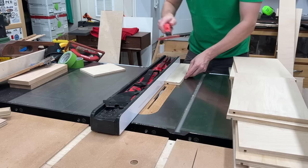I added a quarter-inch piece on the bottom to build up the slide because I'm installing some lateral stabilizers, which require extra room on the bottom so it doesn't rub on the cabinet bottom. You see that wiggle when you pull the drawer out? My drawers shouldn't wiggle — they need to roll. But before showing how to install the lateral stabilizers, I'll get these upper drawer slides in, get my drawer in there tested and fitted.